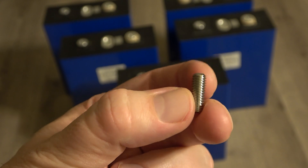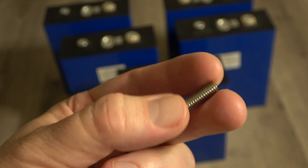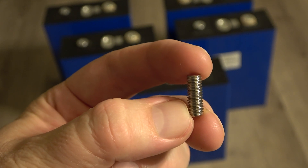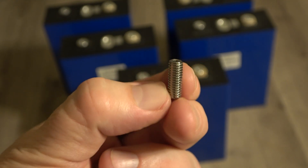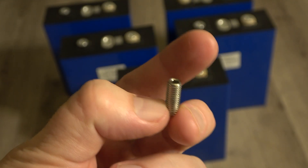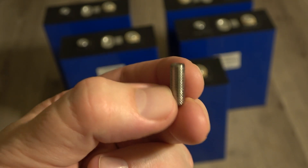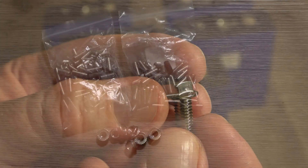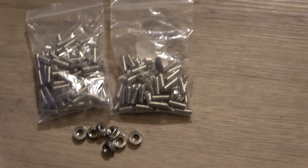So I'm going to go with a slightly different solution. Instead of the M6 Phillips head, I'm going to go with this hex head set screw. These are 16 millimeter, which limits the overall height of the cell for clearance issues inside the battery case. About six millimeters of this is going to be in the terminal, leaving about a 10 millimeter stud coming out of the top, which should give me enough thread while still leaving me enough clearance.